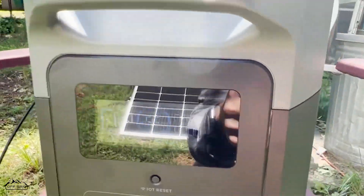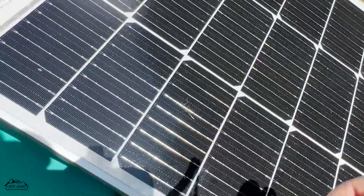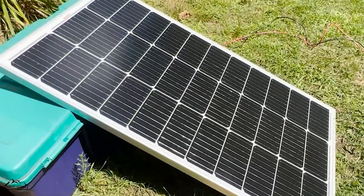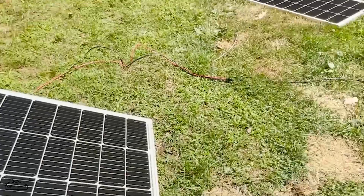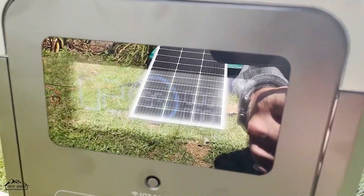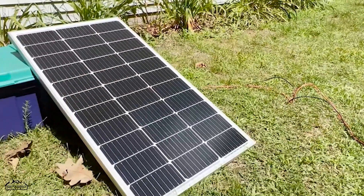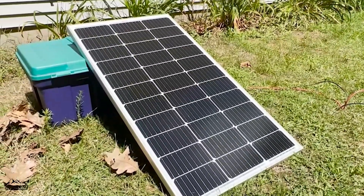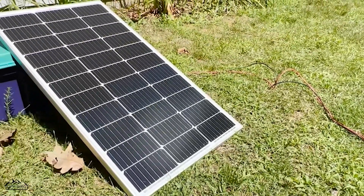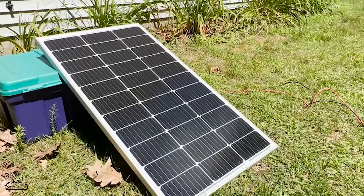Now it's at 81 watts. This just proves that even if you have just a little bit of debris — this small thing right here — you want to make sure you're cleaning your panels and doing the best job possible, because if not you'll get nowhere close to what you want. Right now it's at 81. For the next part of this video I'm going to hook up another panel, so we'll have two panels. I'll do it in series first, throw some leaves on one, throw some leaves on both, then do it in parallel and show you the difference.